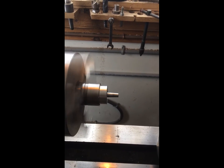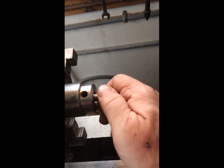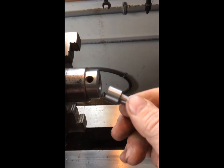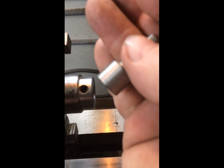I'll put a dial on it, but I think I'll cut back a little bit on that, and I'll have now a chuck for the tail stock. I'll probably remove a little bit of that, put a flat on that for the grub screw, and that's it.